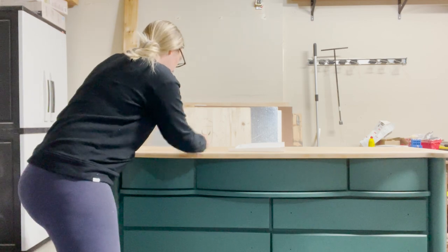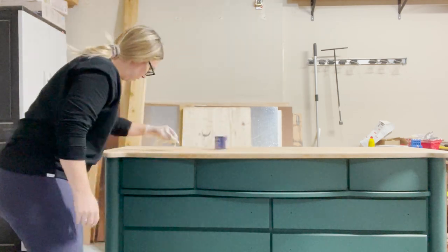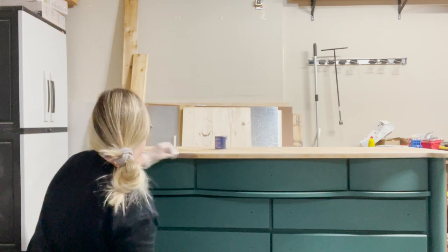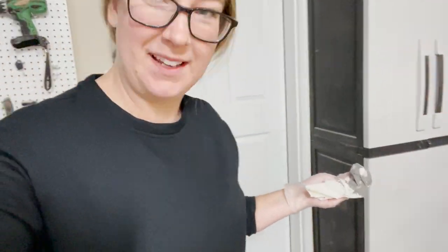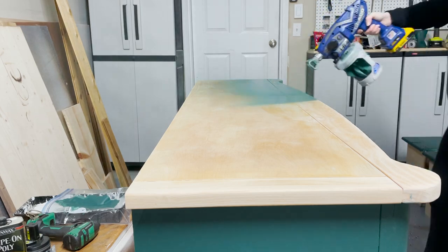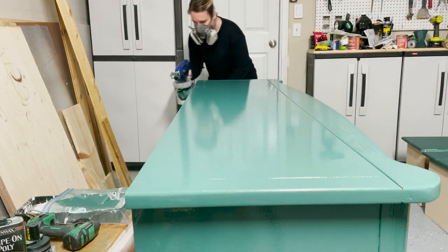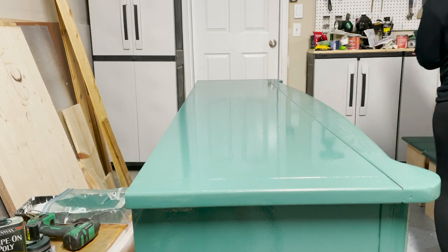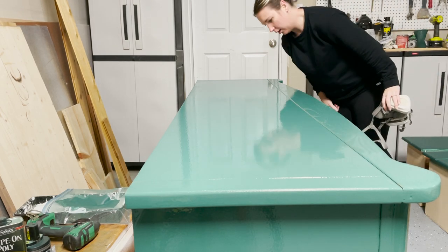I did try to spray this as well, and the spray was fine, but my sprayer is not perfect for small quantities of paint. So I decided to just use a brush. I was trying the top of the dresser in wood — I sanded it down to bare wood and was going to stain it — but ultimately I hated the way it looked. I didn't like the two-tone. So I just decided to paint it the same exact color. Because I went down to bare wood, I did not do a primer — probably should have — but bare wood usually absorbs pretty well. General Finishes Milk Paint is not the cheapest paint on the market, so that is something to keep in mind. As always, do at least two coats and sand with 220 grit sandpaper between coats.